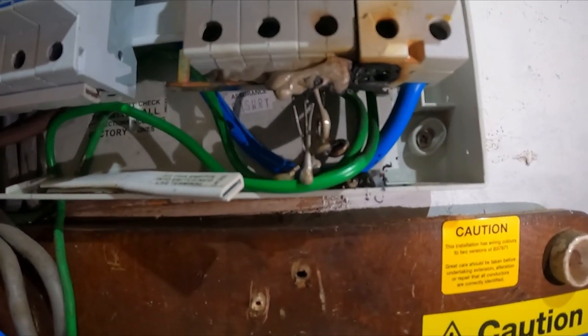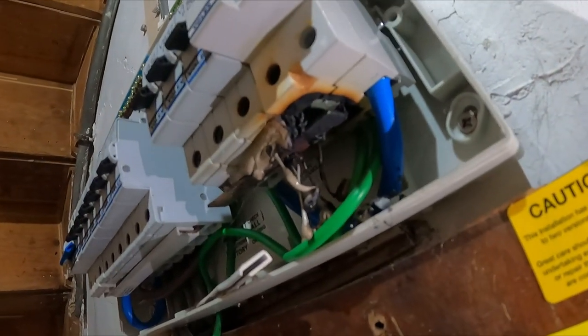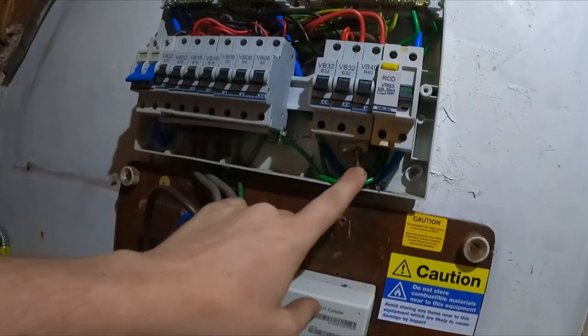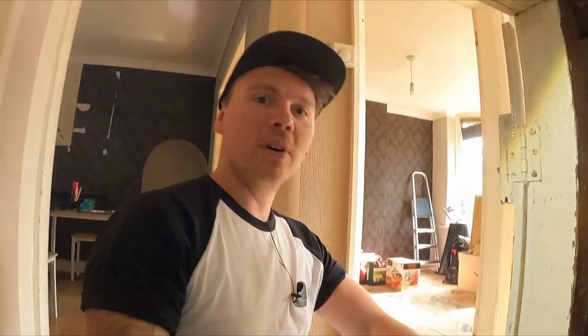He said there were signs of melting — you can even smell it when you take the cover off, sort of a fishy smell. Looking at where it's super-heated underneath, my expert opinion is the bus bar was not terminated to the correct torque setting, or has become loose over time. This does happen — you tighten everything up but over years it heats up, vibrates slightly, and comes loose. That's why with an EICR we go around, torque everything back up to the correct setting, and reset the time limit before it goes loose again.